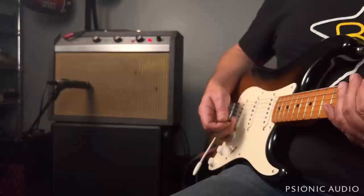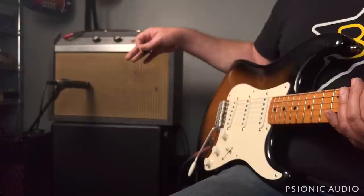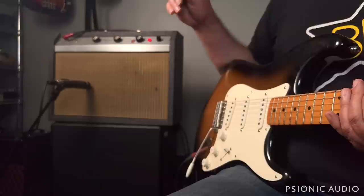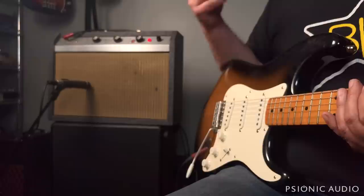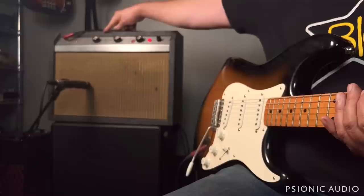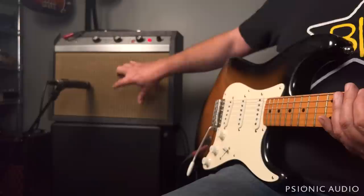This tube should have even glassier highs than an EL84. So as a designer, I would be tempted to put in a fixed high frequency roll-off — I'm talking a gentle thing that starts about 5K and rolls off above there, just to de-fizz and de-glass the output a little bit. Others have increased that coupling cap — the 4.7 nanofarad — which then goes into that T-filter, which does a mid-range notch that you can hear. I'll show that more with the real speaker, and I can eliminate the speaker's issues from the sound coming out of the amplifier itself.